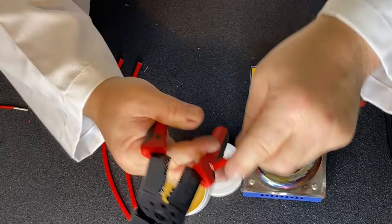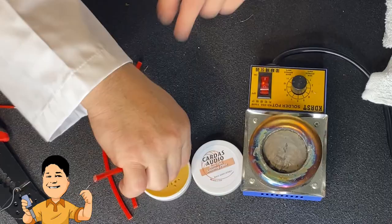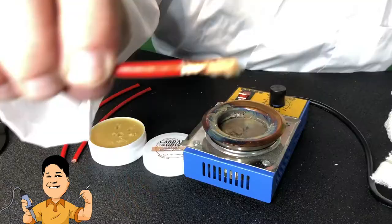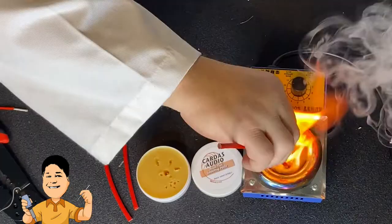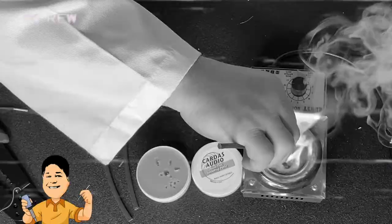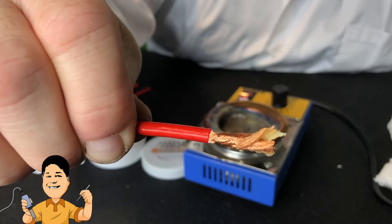And now our largest conductor, the 9.5 gauge. Remember that the wire size goes up as the gauge number goes down. That looks like too much flux to me, but Jesus says it's ready for the solder pot. Oh my god. Let's rewind the tape and see what went wrong. Too much flux. Also, we have the temperature on the solder pot up too high.